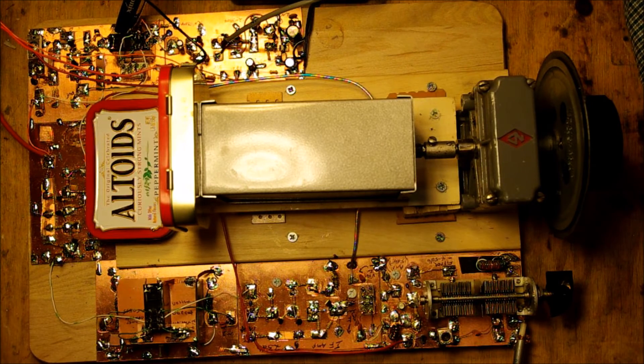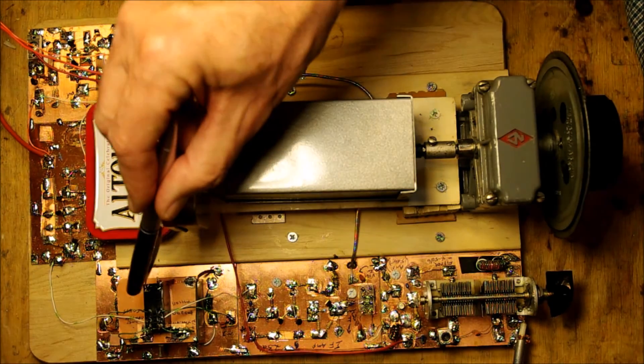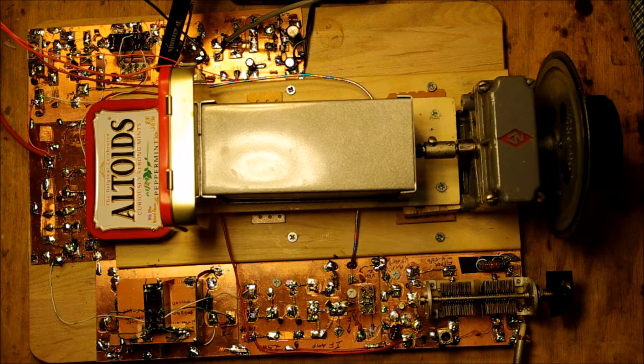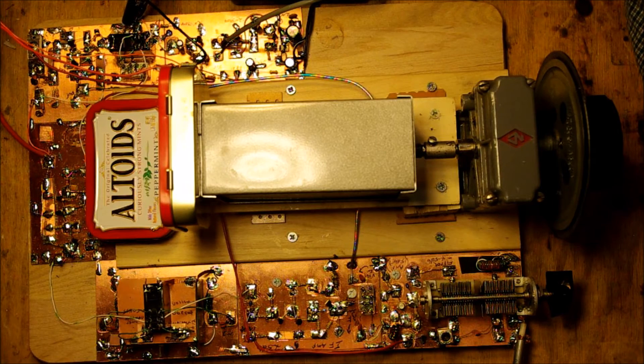This other relay is so that when I switch filters, I want to switch detectors too. I want to go to an AM detector — perhaps a diode detector — something good for detecting AM, not a product detector, because with a product detector you're always going to be listening to the carrier unless you get right to zero beat, and that's a bit of a mess. So I want to be able to turn off the BFO and go to an envelope detector of some sort.